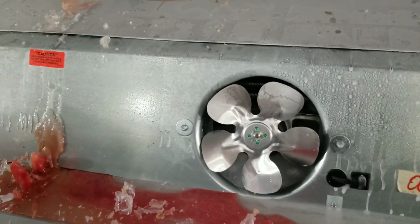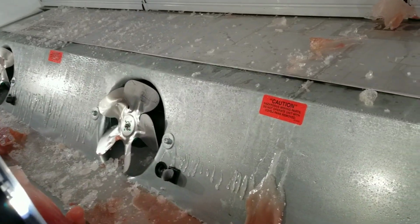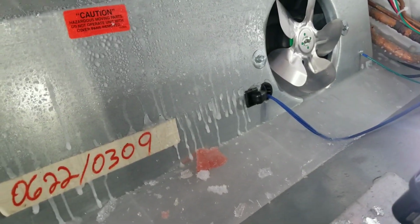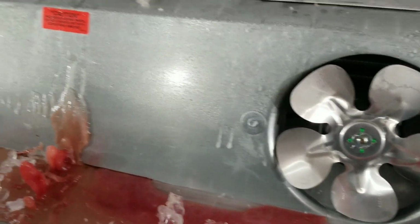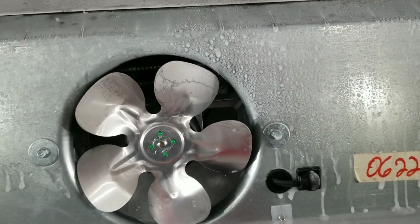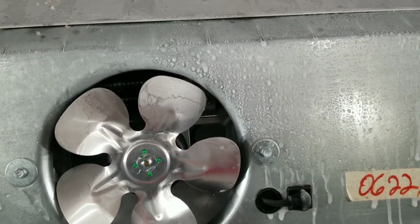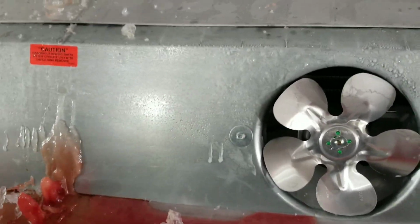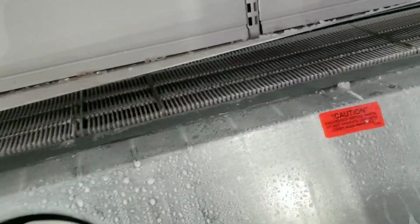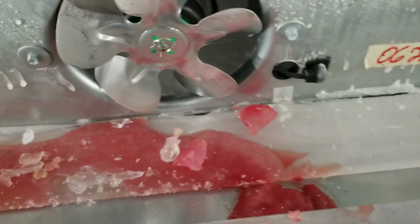So, took a little bit of doing, but I was able to clear off all the shelves above our evaporator coil here. Now, we are currently calling for cool. As you can tell, all of our evaporator fans are stopped from ice building up in the bottom of this pan. So, what that does is once you stop the airflow across your evaporator, you're just basically running liquid refrigerant through your evaporator coil. Your suction pressure drops, and your compressor basically short cycles on and off on low pressure, which is what it's doing right now. So let's see if we can pull this open. There we go. So you pull this right open.